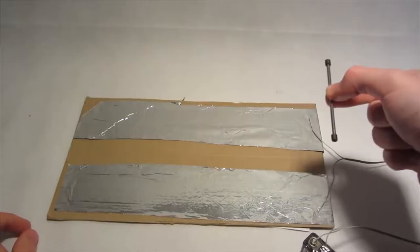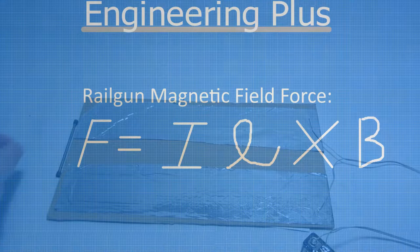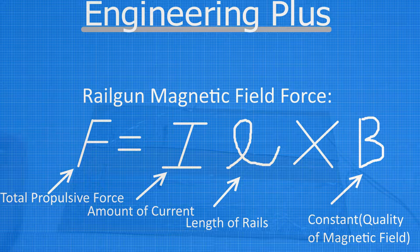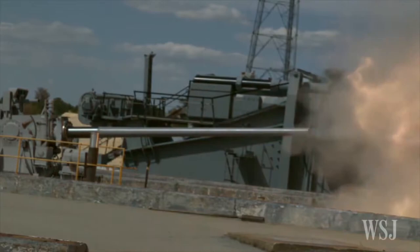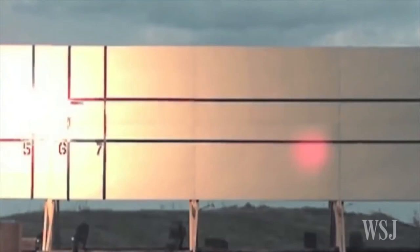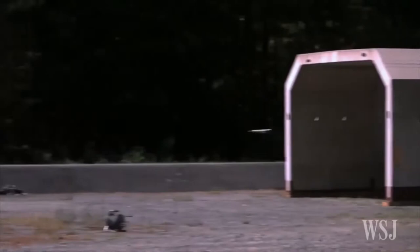The formula for the strength of the propulsive force in a railgun is: F = IL × B, where F is the propulsive force, I is the current or the amount of energy flowing through the railgun, and B is the constant or uniform strength of the magnetic field. The longer the railgun becomes, the more powerful the magnetic force becomes. Similarly, the more powerful the electrical current, the more powerful the magnetic field. This current flowing through the railgun behaves as an electromagnet, creating a magnetic field inside the loop formed by the length of the rails up to the position of the armature.